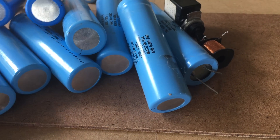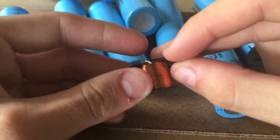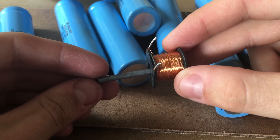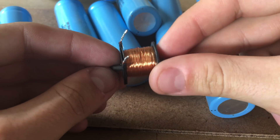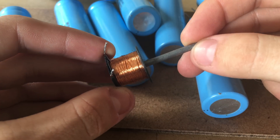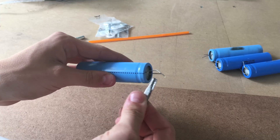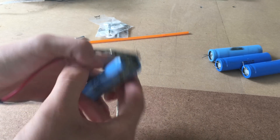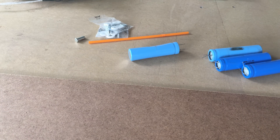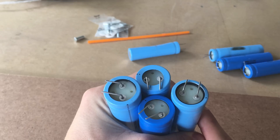You're going to need a lot of capacitors. The capacitor and the nail will continue flying forward with its initial momentum. Here's a quick demonstration of the kind of power that these capacitors can hold. I'm going to charge up just one of these capacitors, positive to positive, and negative to negative. If you blinked you missed it, but it was a pretty good spark. We're going to be wiring all of these capacitors in parallel, which means that the capacitance adds up and the voltage of the bank stays the same. So we're going to be charging the bank to about 38 volts.